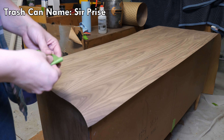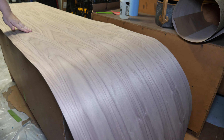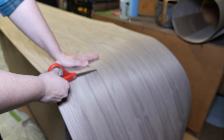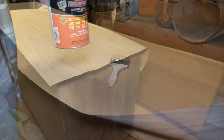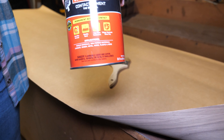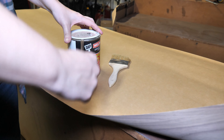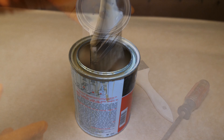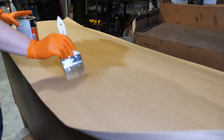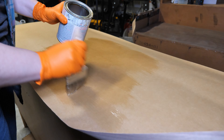To attach the veneer to the laminate, I scuff sanded the laminate with 150 grit sandpaper and then wiped the surface clean. Next, I cut down the veneer so that there isn't as much excess overhang while I'm trying to attach it — you'll want to have a bit of overhang to ensure that you properly cover the whole piece. To attach the two substrates together, I applied contact cement using a chip brush to both surfaces. In my experience, it is a good idea to apply two coats of contact cement to the paperbacked veneer, as the paperbacked stuff seems to soak up the contact cement. Once the contact cement is dried per the instructions, I placed dowels across the top of the surface so that I could adjust and slowly press the two surfaces together. If you've never used contact cement before, once the two surfaces touch each other, they adhere — so the dowels give you more control.